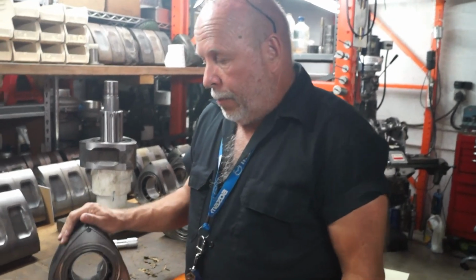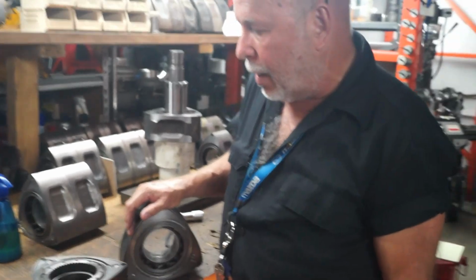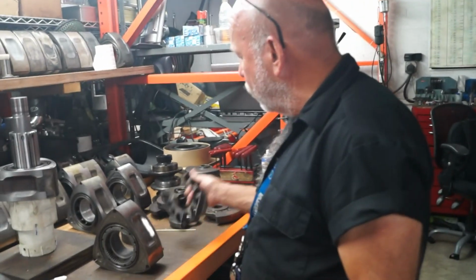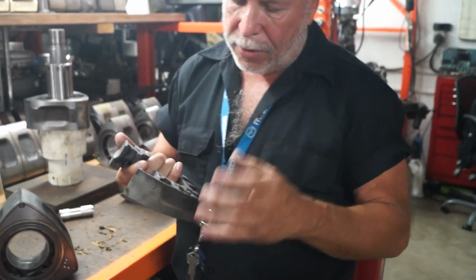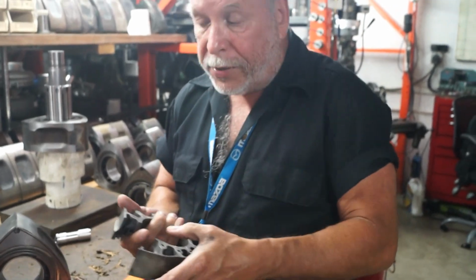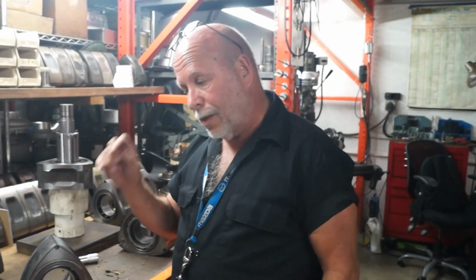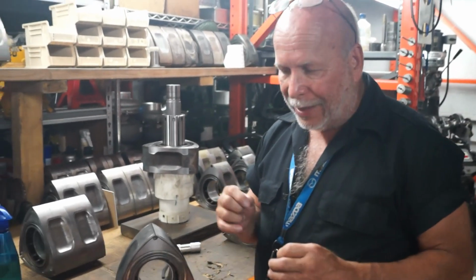Yeah. You've got to chase these invisible forces in rotaries. That's why it is a black art, like you said. You're dealing with a lot of invisible stuff. That's why I have so many rotors that are cut up like this, so that I can go in and weigh and measure to see where there is material, where there isn't material. You have to get very artistic and inch at it, little by little, little by little. At snail pace, you can get it to where it's like you just saw it.